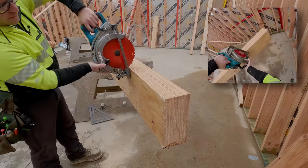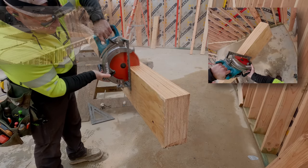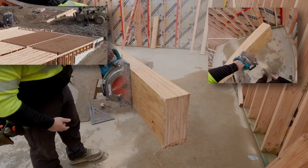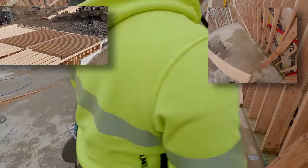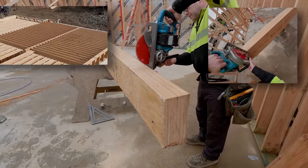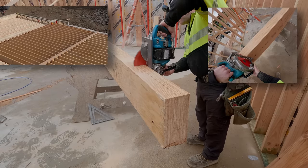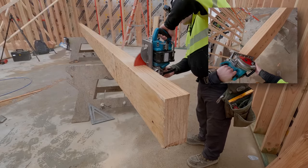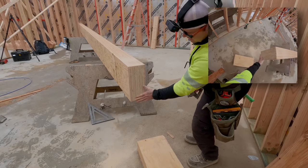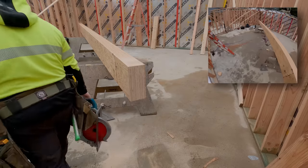In this video we're going to get into the framing of the floor system that goes above where I'm standing. This is actually going to support our garage slab — two-car garage. So the main beam running through the center, and I'm going to follow this up with its own video. This video is specifically about installing the I-joists, how to cut them efficiently. I'm cutting with this LVL on edge because I have to lay out both sides for hangers.